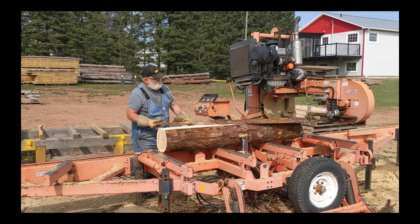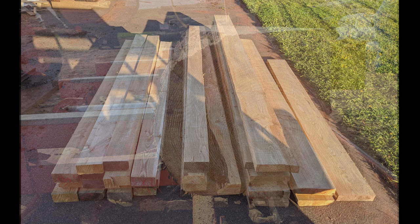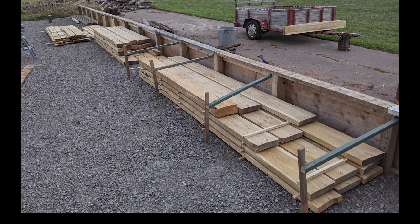Here you can see the sapwood, the lighter outer layers of the log. This softer wood is to be avoided, as the wood for boat building should come from the harder interior heartwood. With the larch now home, I stacked it according to size to continue drying. You can see I obtained my first order well before the boat shed was even completed.